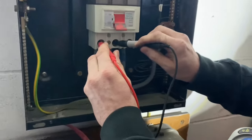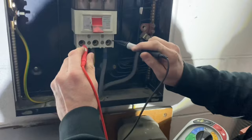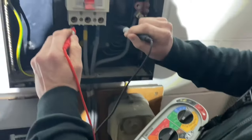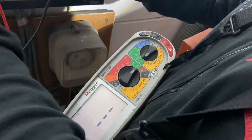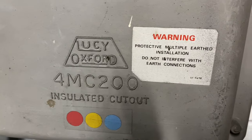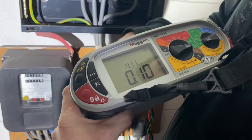Keeping the instrument on two-lead high in the L-L setting, we probe between pairs of line conductors. Phase 1 to Phase 2 gives 3,280 amps. Phase 2 to Phase 3 gives 2,790 amps. Phase 1 to Phase 3 gives 4,110 amps. These readings differ from doubled line-to-neutral because this is a TN-CS system, where neutral and earth are combined. The line-to-line results are not exactly double, but the rule of thumb remains valid for exam purposes.